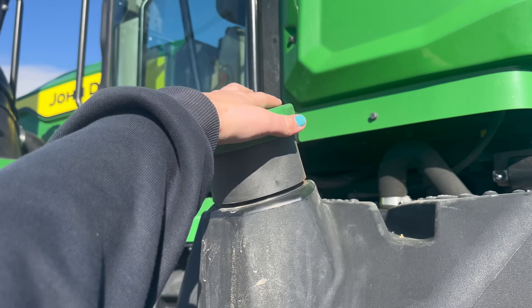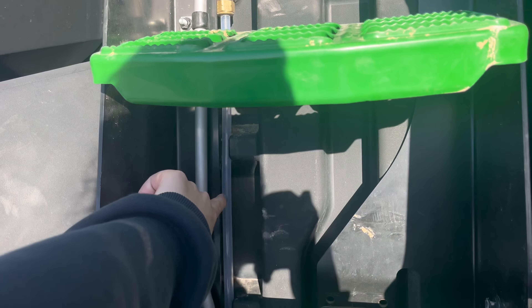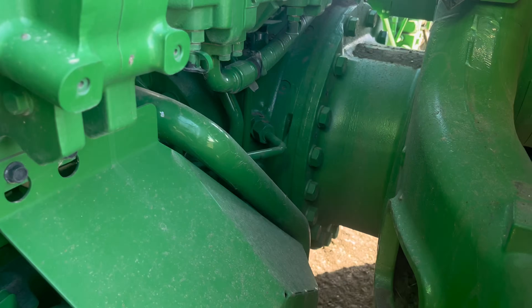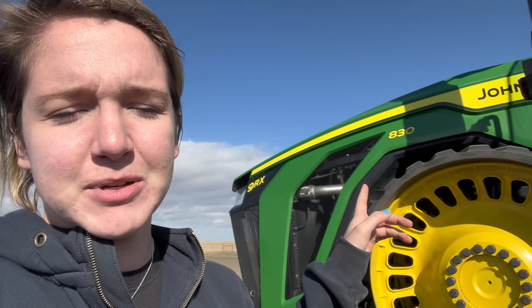Your fuel is ground fill — I'm standing on the ground, it's not up there anymore. Your fuel sight gauge is right here, your hydraulic sight glass is right up here, and there are a couple more sight glasses for transmission fluid. From inside the cab there's your engine coolant sight gauge. In an effort to minimize servicing time in the morning, all of those gauges are pretty accessible — you don't have to lift the hood to check your coolant. You can also set the reversible fan to automatic, on a set interval of minutes between blowouts, or just an instant blowout.